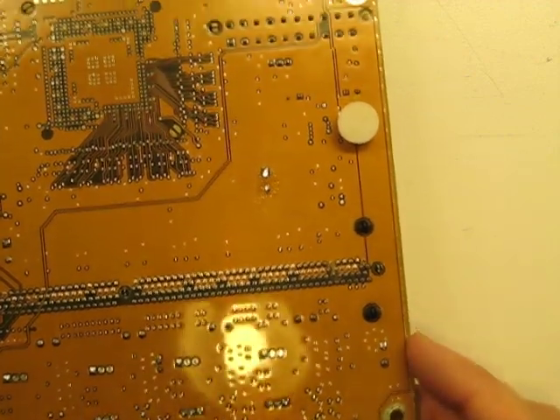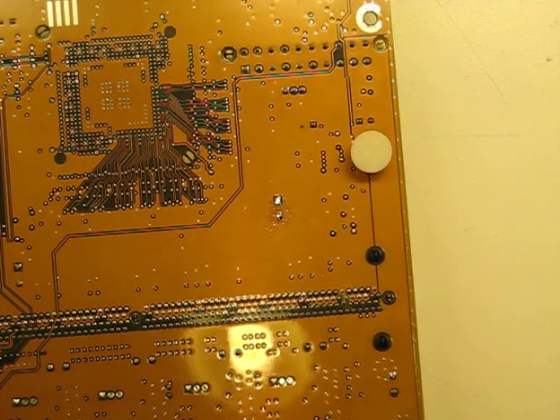I've already fired up the iron. It's about 700 Fahrenheit, figure 375 Celsius or so. It's a Hakko 936. Wattage I'm not entirely sure about — 20 to 40 — but it's temperature controlled. And I've got some solder. This is .025, 6 tenths of a millimeter.